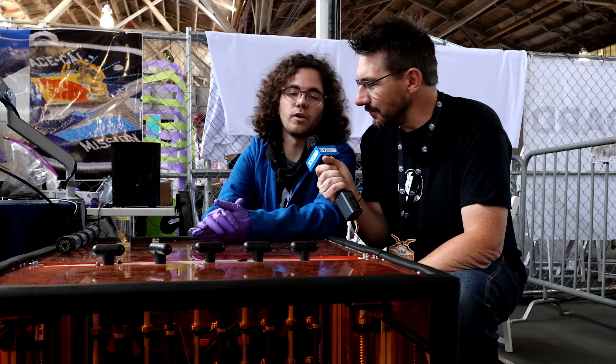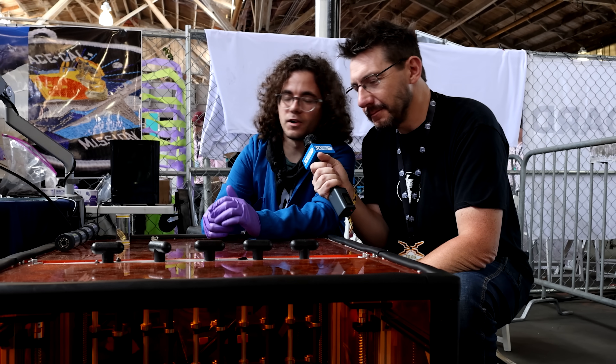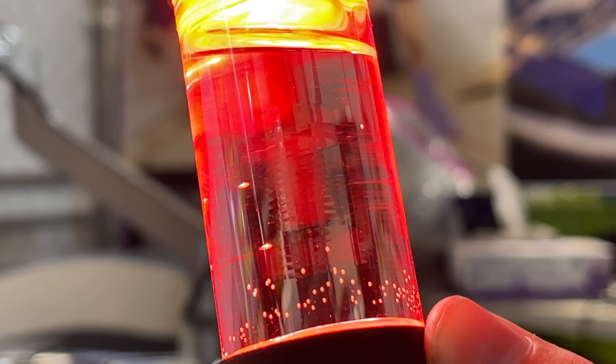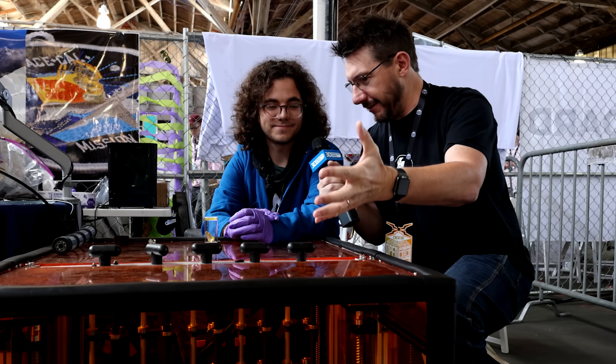It's what's called a volumetric process. Most 3D printing processes build up layer by layer. We do something a little different — volumetric printing. We form every part of our geometry all at once. Because of that, we print very, very fast, because we're forming the whole part at once. You're not doing traditional additive. If we think about an FFF process, we're forming the first layer and going up in Z. We just print it all at once — it's just going to be there.